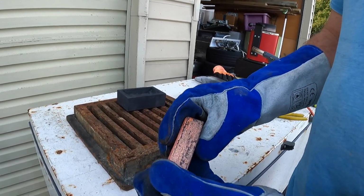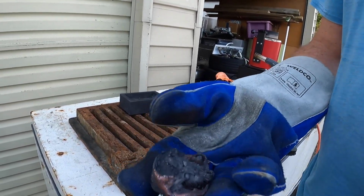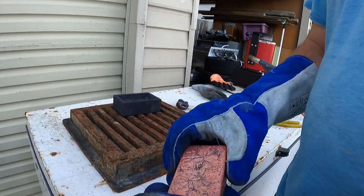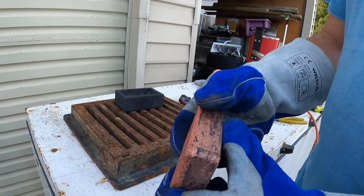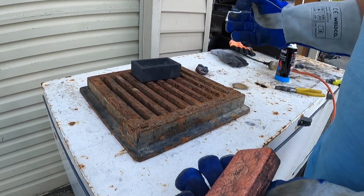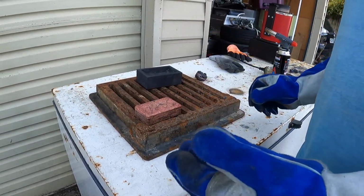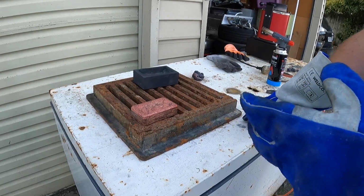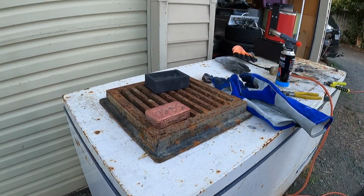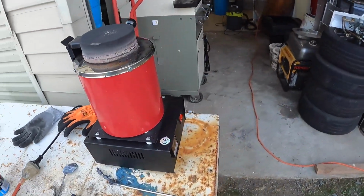Some of it's all that wire, some of it wasn't. As I said, I stopped after I got this out. I stopped using the wire and I went and got some copper pipe and whatnot from the bin inside, and then I just used that. So for these furnaces I would recommend not melting copper wire unless it's 100% clean, because as you'll see quickly now, the same problem arises that I had in my first crucible.